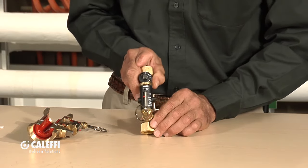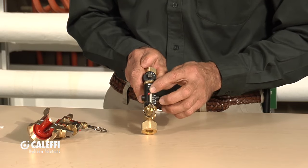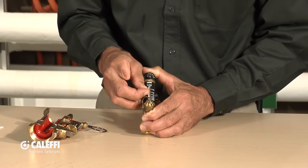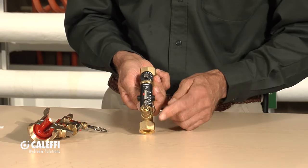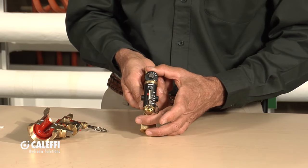Let me show you how to use this. You pipe it in, start up your pump, and then this little red arrow on the front is movable. Take your fingernail and just move it to the flow rate that you need in your system. Let's say we're going to set this one at 1.5 GPM. Just slide it to that. When you pull this ring, it's going to divert the flow through there and you're going to see a little ball in there that floats up.